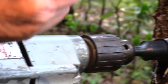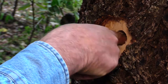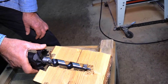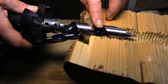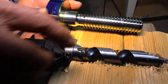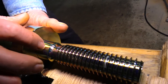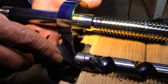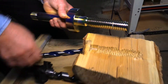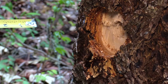I can tell we're at least into our minimum depth — it's an inch and an eighth and you can see the lip in there. It's really important that you line up all your bits. The three-stage bit lines everything up: it does the one-inch part for the inside diameter of the thread, then the inch and three-sixteenths for this part, then the three-inch. It lines it all up perfectly so everything bears at the same time — here, here, here, and here.